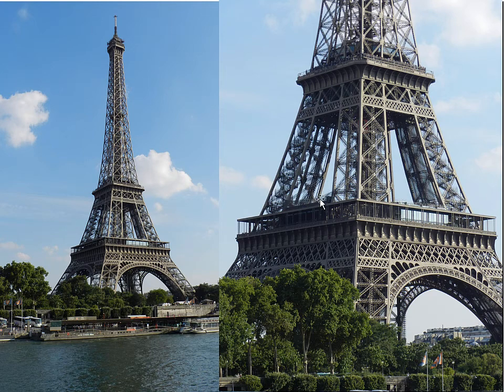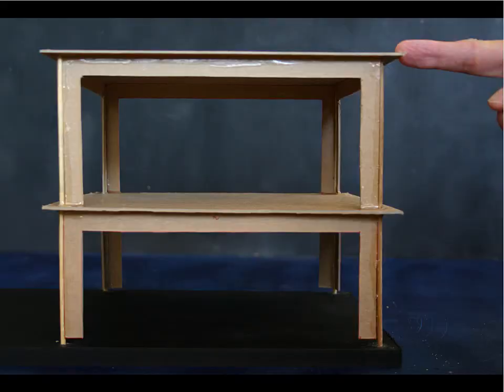So we have a square in sort of plan, or if we cut a section through this, we have one, two, three, four corner pieces, and there's a sheet of material on each of those faces. So those are mutually braced sheets of material. And then if you look really close up, you have exactly the same pattern of truss work in these web members. So it's truss, then it's truss again, and then it's truss again. So there are three levels of trussing. But the crucial thing here is everything in this building has a mutually bracing sheet of material. If there's a sheet of structural material, there's a mutually bracing sheet that helps to keep it stable.